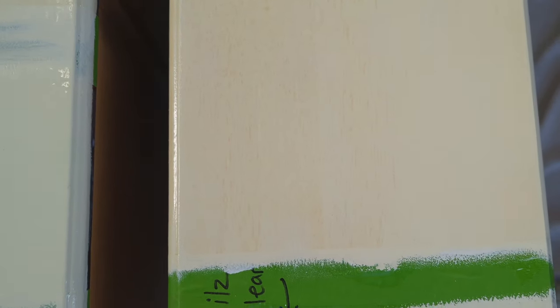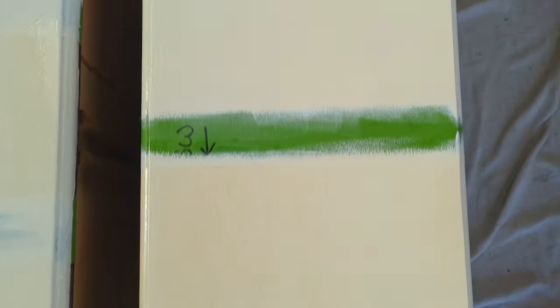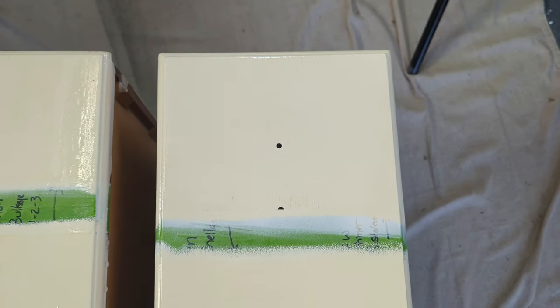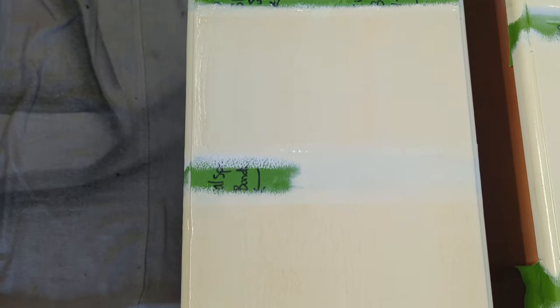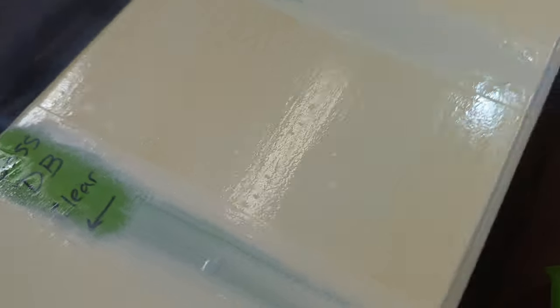We already have a clear loser — you can see it right away. The shellac section looks great. The spray paint section also looks good — so if you're going to cut costs, at least get the spray paint. The Valspar bonding primer is showing all sorts of orange popping through — it's bad.